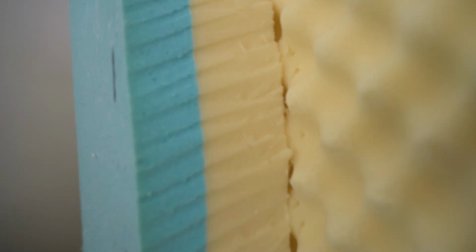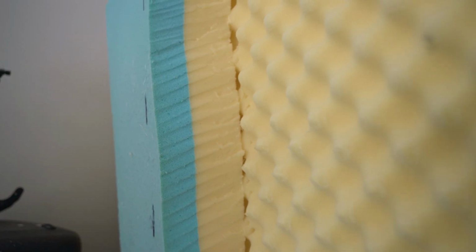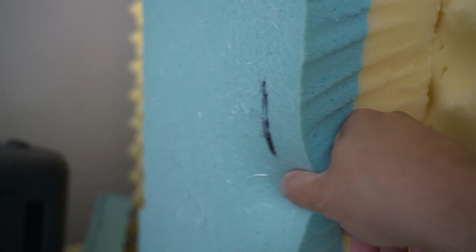And now that I have a lot of that done, I'm able to focus and really lock in on my studio. So what I'm building today, I'm gonna show you some of what I'm working on as far as my sound panels. I'm actually repurposing our old memory foam mattress. It's a really good quality foam. It's 12 inches thick, and I took about 6 inches of the most sound absorbent material that I found from it. I basically split the mattress in half, cut it into sections, and came out with these really dope looking sound panels.